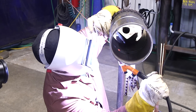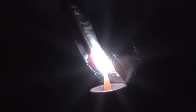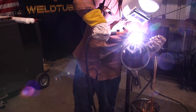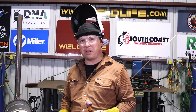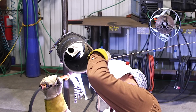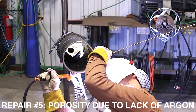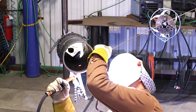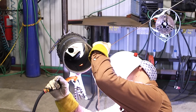I got that side all filled up and cleaned out that tungsten inclusion. I'm going to start coming from the bottom up. On this side, we're going to simulate somebody stepping on our argon hose or turning off the bottle, mistakenly thinking it was theirs. This kind of stuff happens a lot on the field during shutdowns. It's going to create a ton of porosity, make a mess, and mess up the tungsten. We'll show you how to get that all out once it happens. Go ahead and shut off the gas.